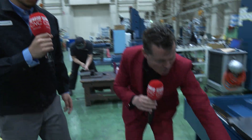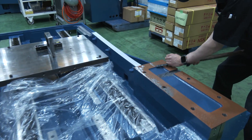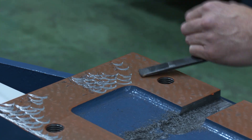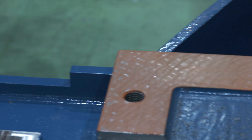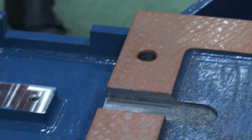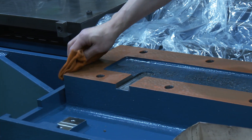It looks like there's even some small painting in this area. So this is your hand scraping obviously. We do paint first, then we put up this heavy column on the bed and check the contact surface. If you take a look at this side of the surface, the black area is the actual contact surface. As you can see, the contact surface is not everywhere — it's very limited and not well balanced.